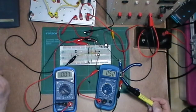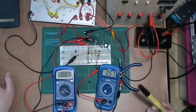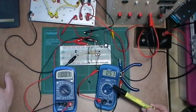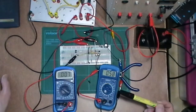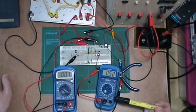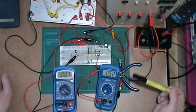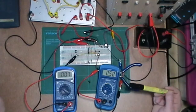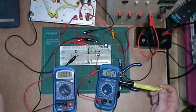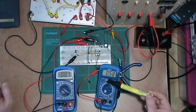Now I could do the calculations for that, which I have actually already done, because I was having a look at this before to make sure I get it right. That comes in at about 90 odd thousand. It's nearly 100,000. If this settles down, that'll probably go up as these transistors warm up. I'm expecting that will probably go up a little bit. So in theory you could end up with 100,000 on the gain. At the moment it's not quite that.